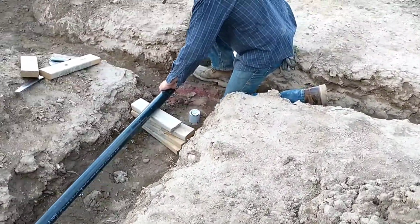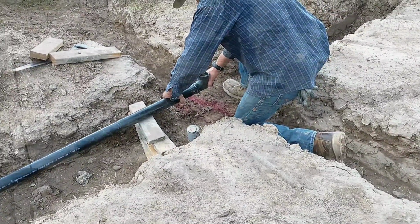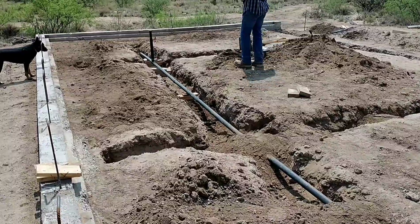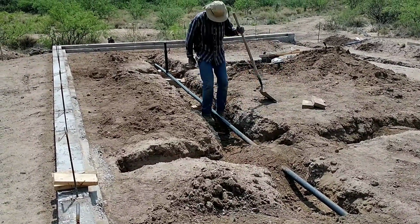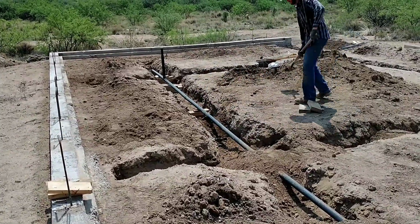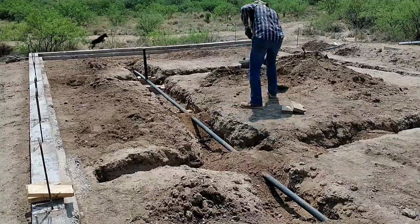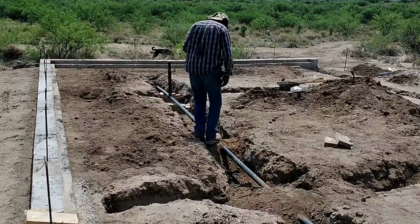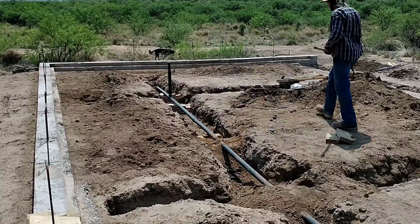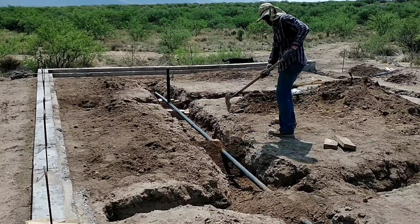That's the black pipe you see here. And I came in with a 3-inch line, and then I split off to 2-inch lines going to each bathroom. The gray water drain doesn't need to go to the kitchen. I'm only collecting gray water from the bathrooms, and specifically from the bathroom sink and the bathroom shower. You can't collect gray water from your kitchen sink because it has the food particulates, and it's not good for use in the gray water system.